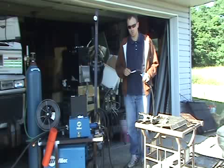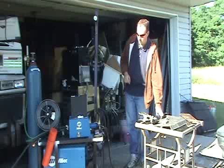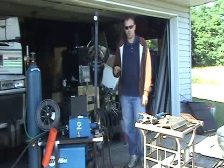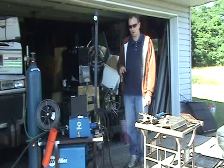This sticking is caused by dirty wire, especially from grinding dust. You don't want grinding dust on your wire — it'll make it stick in the tip, and it's hard to remove from your wire.